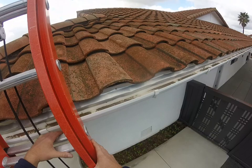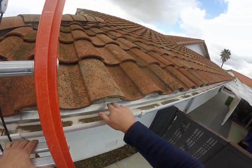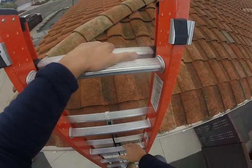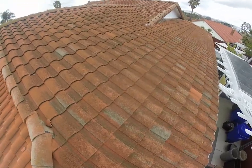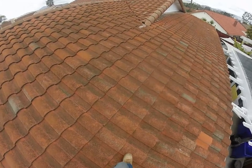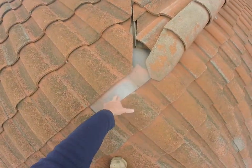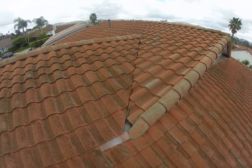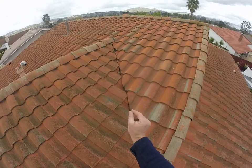With our new roof going on, we'll have a piece of drip edge that accomplishes the same goal, so I would recommend getting rid of this piece of metal as well as these gutters. These tiles are still very strong but are losing a lot of their color. I would say this is the original roof and it was installed very well. This flashing here has saved a lot of issues — don't know if it was originally installed or added after the fact.